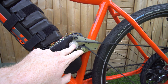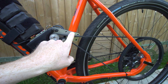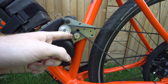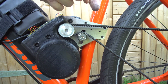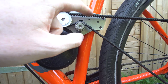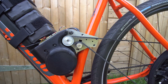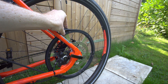Moving to the main drive output pulley to the rear wheel: this is a 20-tooth pulley driving a 1500mm belt. There's an idler bearing mounted in a slot with a T-slot nut on the other side of the plate. All I have to do is loosen the bolt, slide it up or down to tension the belt, then tighten it and it locks in position. To get the belt on and off, I just loosen the bolt, slide it down, and the belt slides off the side of the pulley.